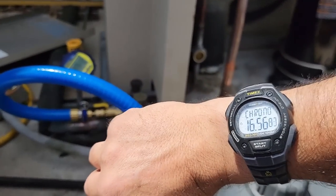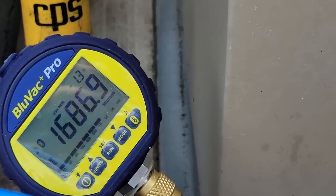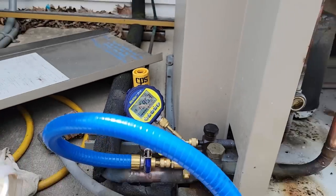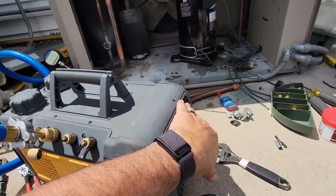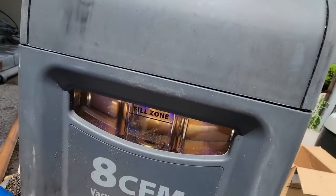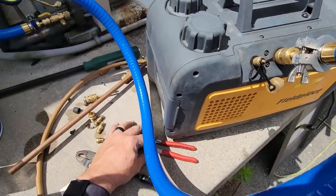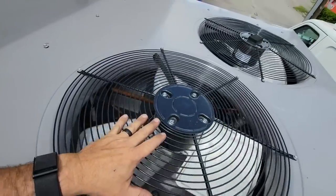We're at 16 minutes area. We're at 1600 microns, which kind of slowed down there. I just recently took the gas ballast and closed it. Oil's not looking horrible — looks a lot better than what it did earlier. May need to do an oil change, it may not be a bad idea. I think it's been a while since I've changed it.